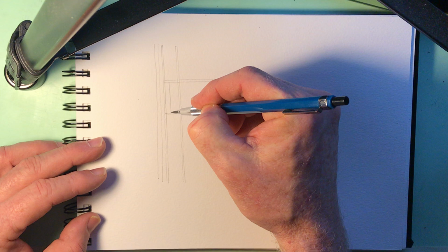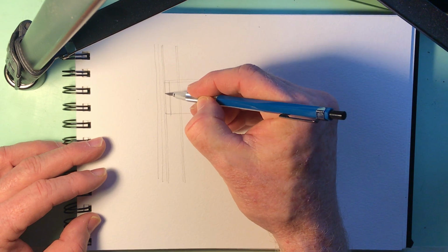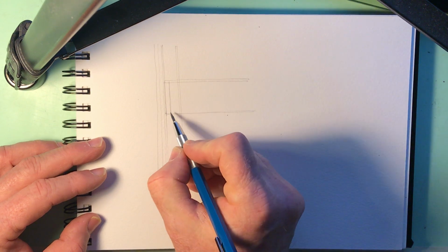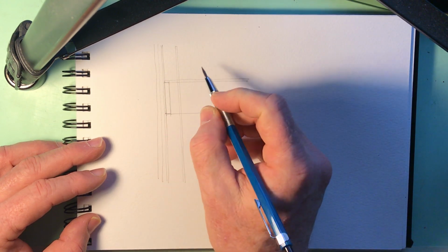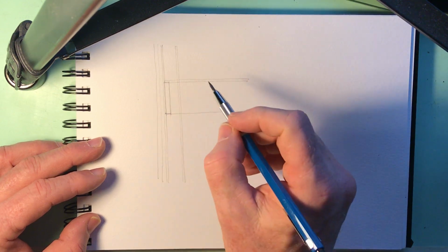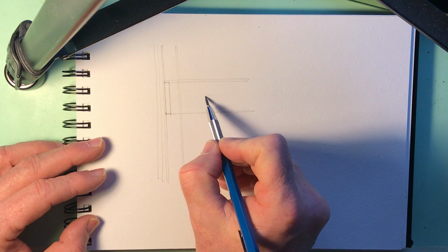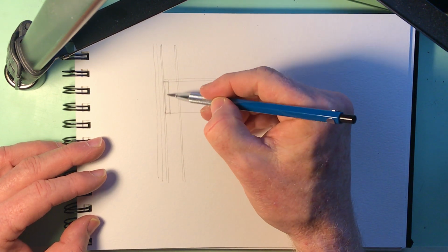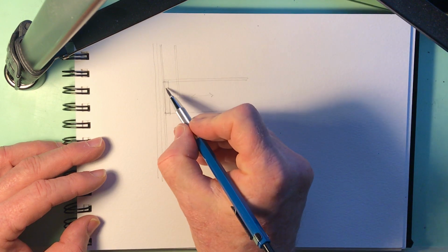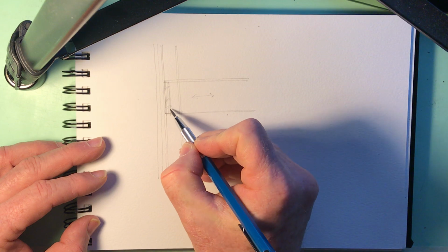Now, on the edge of your floor system, there will be a joist called a rim joist, R-I-M, as in the rim of the joist system. And for purposes of this illustration, the joists are running this direction, except for this rim joist. So this rim joist is like this. And it's most likely going to be an LVL product of some sort.